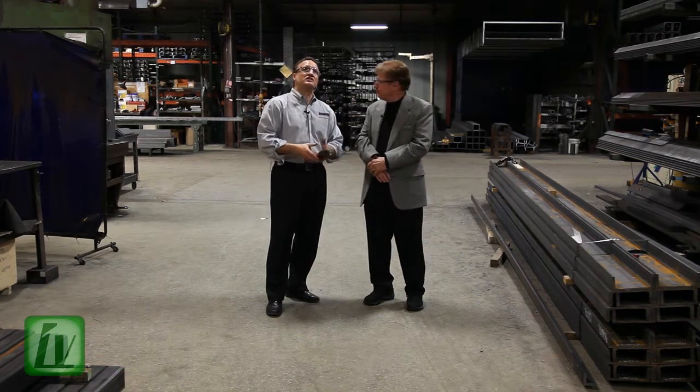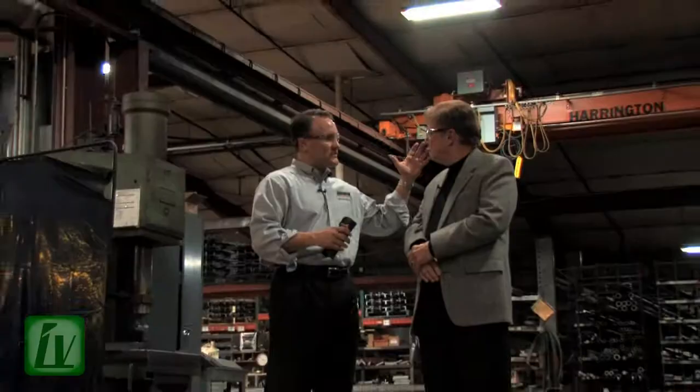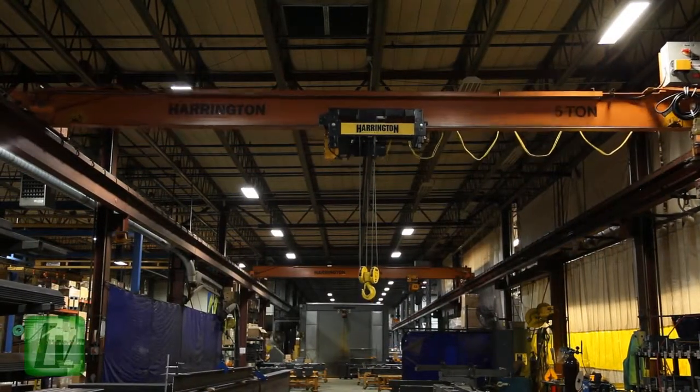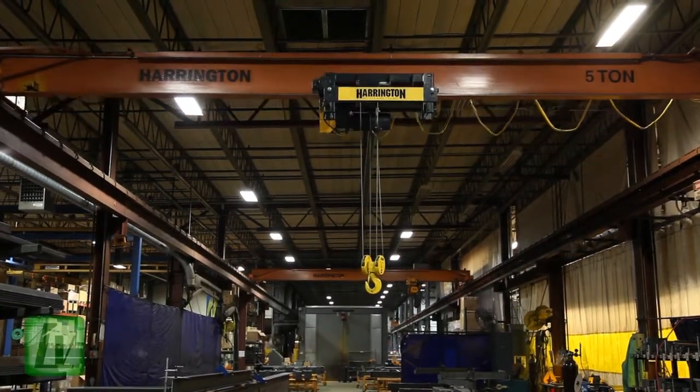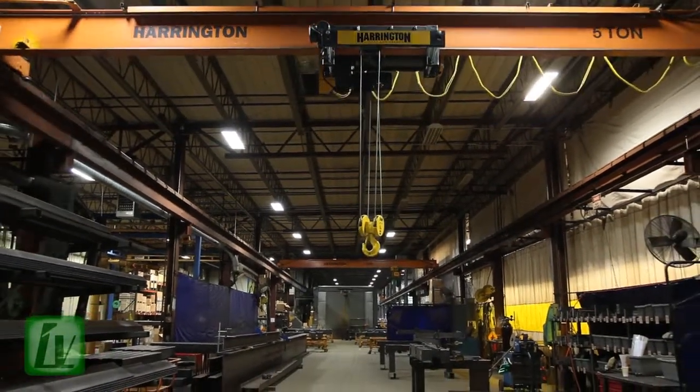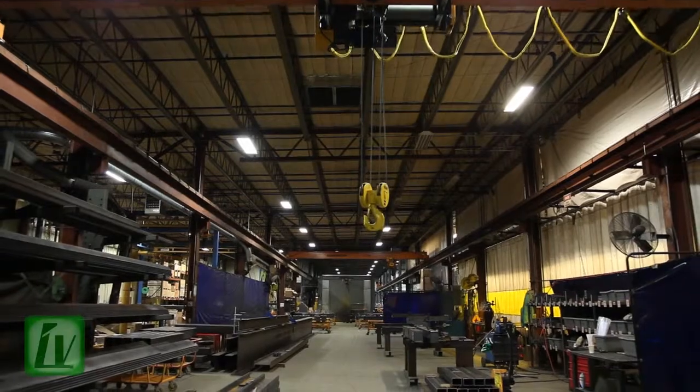Okay. A couple other functions about it. You can tie in some sirens. You can even tie in a strobe light so that if one of these functions kicks in, or just for simple movement of the crane, I can tie that into the RPU as well. And the two really nice features, the main feature of the Rhino Protection Unit is the count hour meter, which gives me run time, number of hours on the hoist for things such as preventive maintenance. And probably the neatest feature is what we call the motor management device.